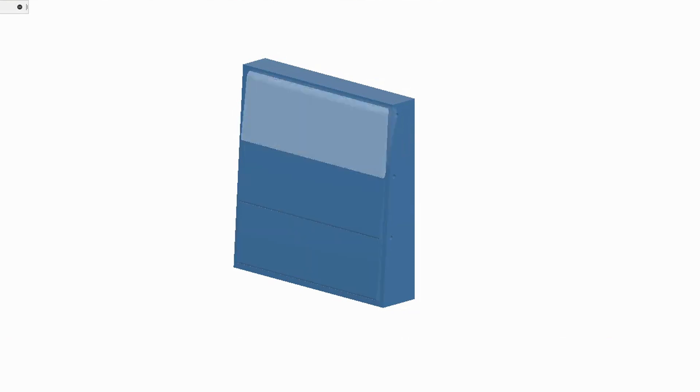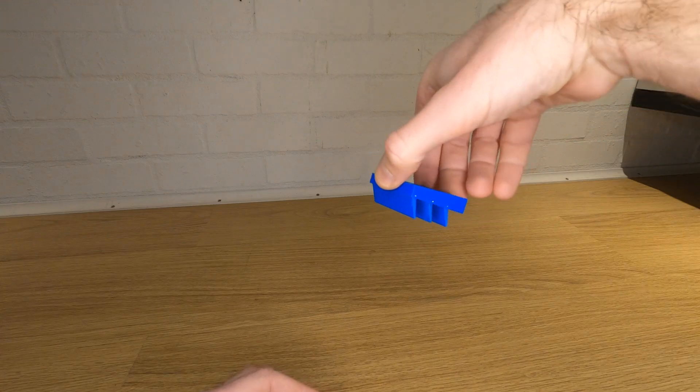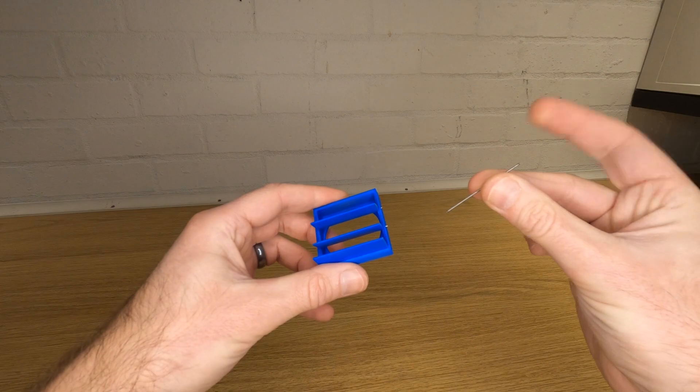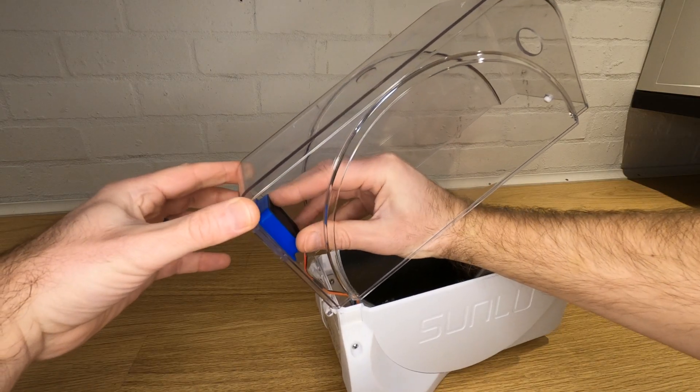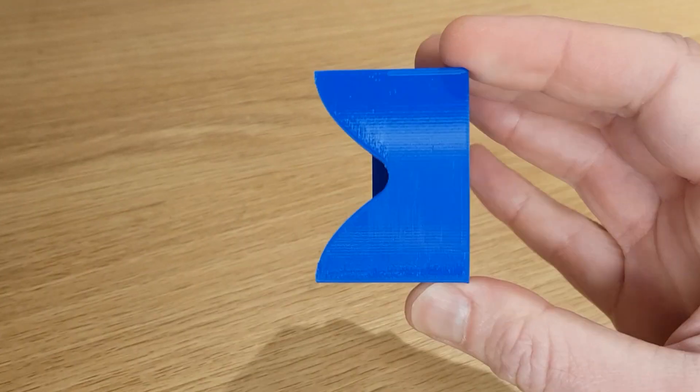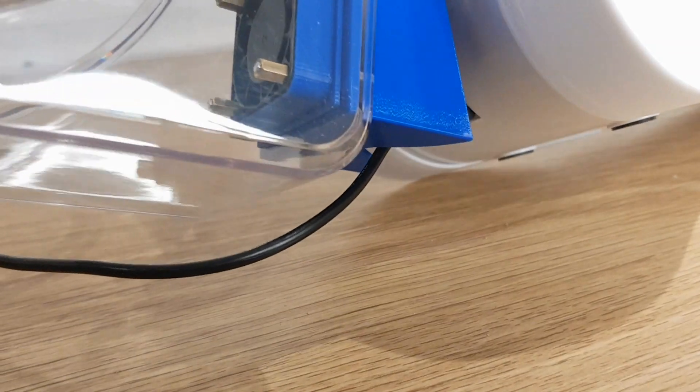Make sure you download and print all of the files needed as you go — all the 3D printed parts are free and available from the links in the description. Start with the vent housing and the 40mm fan blades. The blades may need a little cleaning up so they move freely on the pins, which need to be made from 0.9mm wire cut to 47mm long. The fan and fan shroud sit on the inside but everything else is on the outside of the box. The blade shield was redesigned on the Mark 2 so that when you open the box it clears the plug.